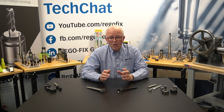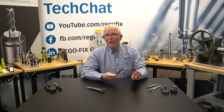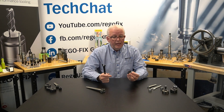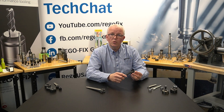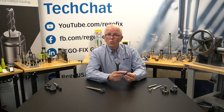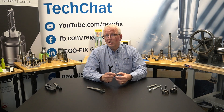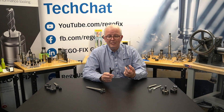One last innovation to talk about is the A style nut, or the externally threaded type of nut. These have been around for a long time and you'll find them on your live heads, floating heads, spindle speeders, and angle heads in your machine shop. They have a hole pattern on the face and different pins in the wrench that go into those holes to allow you to tighten or loosen. The only problem is these pins wear or the holes wear, and you start slipping off. We see a lot of customers take these old nuts and grind flats on them so they can put an adjustable wrench on to tighten or loosen — and that's really not a good process to have in your shop.